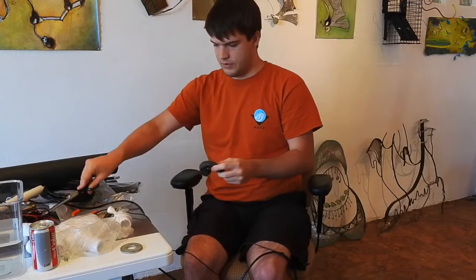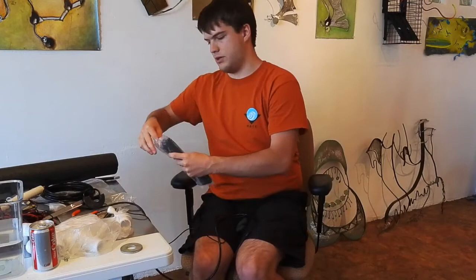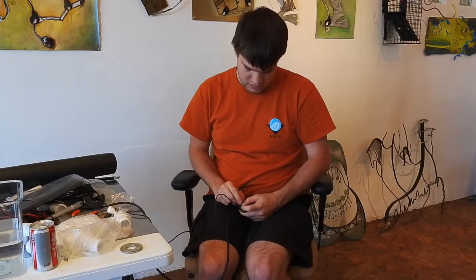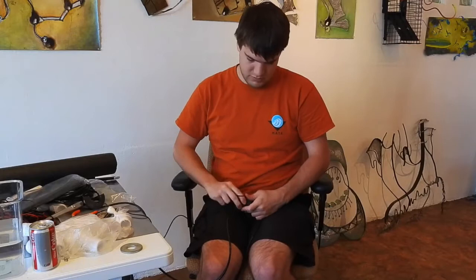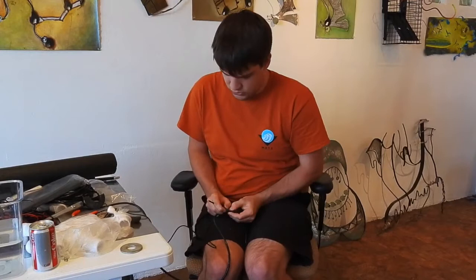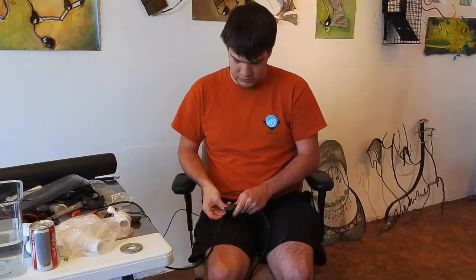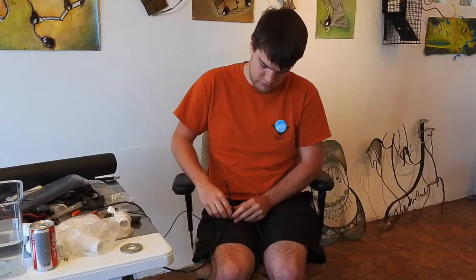Put some foam on your tether, because your tether will be too heavy — I can guarantee it from experience. You can just put this on here. Instead of separate zip ties to combine the cables and separate zip ties for flotation, you can do it all together. Just crank it down so it compresses the foam a bit so it won't slip out the ends. Trim it, and there you go — some flotation on your tether.